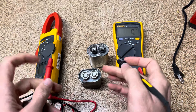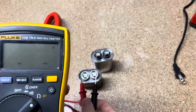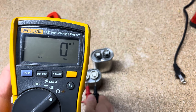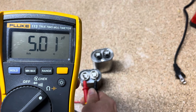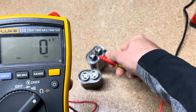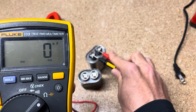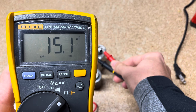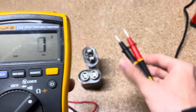We're going to go ahead and take our readings. I'll try to hold this up so it's a little closer to the screen — you can see I'm just going to touch these, touch the test leads one to either terminal. You can see there's just over five microfarads — that's good. And here's the 15 microfarad capacitor. Touch it, and you can see you can actually do it either way. The positive and negative does not matter with the capacitor — at least for this test it doesn't seem to. It'll measure it either way.